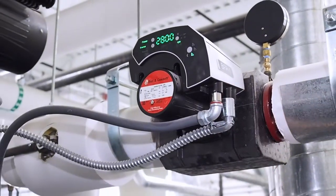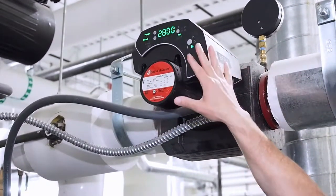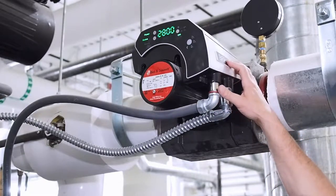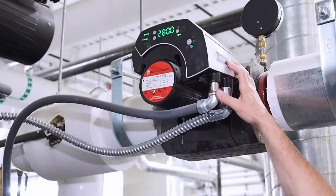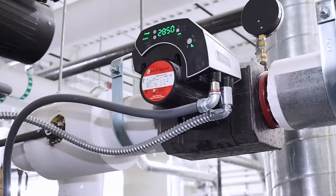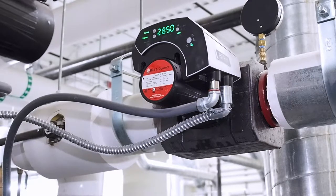The RS-485 is the communication mode that we're locked into. I can't tell what the communication lock is right now because we have to power it down and back up. But when you power it down and back up, you will see it will say none, it'll say Wi-Fi, or it'll say 485 on the display — that's telling you the communication mode that it's in. And the speed reference comes in on terminals that are not dedicated to the RS-485.